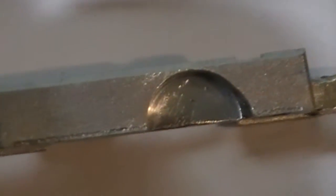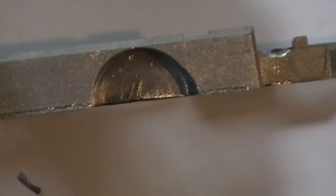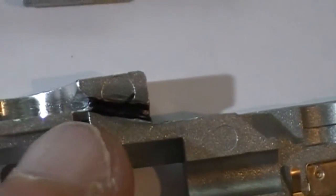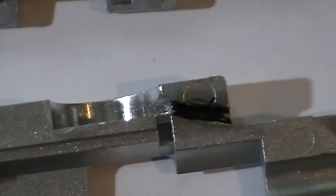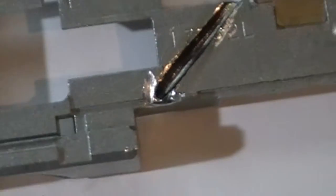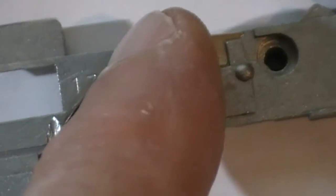And once again, we're in the mill. It's a half inch hole, and then we put a 3/8 inch cutting bit in there and moved it forward a little bit just to give enough room for those wires to get out. I also chamfered the edge right there so the wires can go around. After I cut it with a disc, I used the little wire wheel on it to smooth it and make sure there weren't any burrs. Then on this side, once it gets out, the wire will come up this side here, and then go up this side.